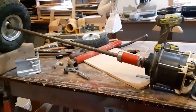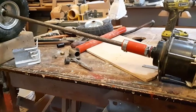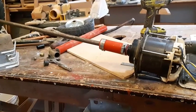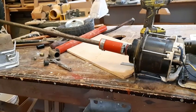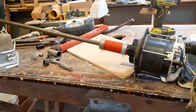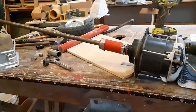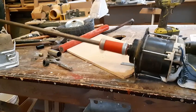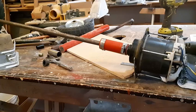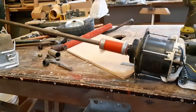So the motor itself won't shake. We'll see what the tire does - I screwed the rubber of the tire to the wood block and basically clamped the block, so that's all very temporary. Let's try this again. I want to run it for a little bit so that I actually see the wear and tear, because I'm not necessarily sure I'll line up the shaft perfectly, so there'll be some vibration. That's why the rubber might work pretty good. I certainly want to work on the balance a little bit to avoid the noise. That's pretty good.